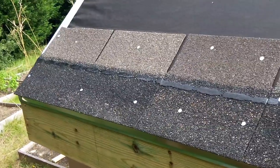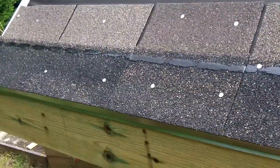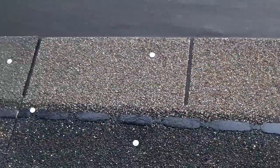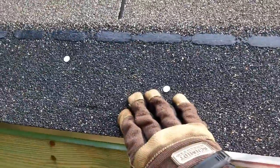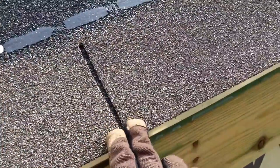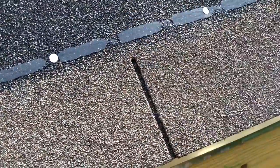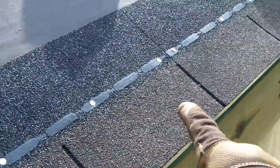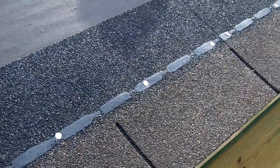If you look at these shingles you might ask why are they upside down — I asked that same question to my friend who was showing me this. It's a starter row. What you do that for is because when you've got your shingles, these channels are open and they're normally facing this way, but for the first row you flip them so that when you put shingles on top, this seam here isn't touching your tar paper — there's another shingle underneath. So when water channels its way down, it touches a shingle instead of the tar paper or your structure. That keeps water off your structure, so I've got the starter row done.